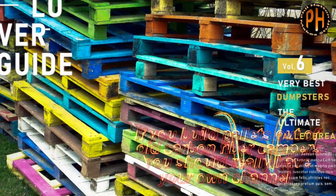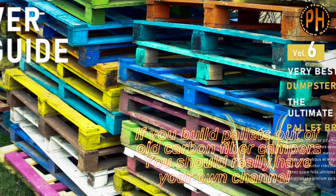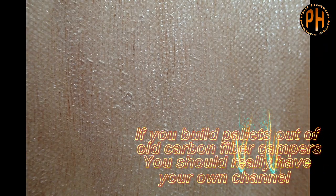Before we get to the epoxy-a-thon, it's important to note that you will be dealing with bubbles and air pockets. They're inevitable, and you can live with them or you can fight with them. Unless you have a large budget and you can do one of those slick vacuum bag jobs, you will get air pockets, especially where there are corners. That's why in the last video it was so important to round over the corners and make sure we didn't have any voids or unfilled crevices. If you get any bubbles or have difficulties, they will probably be at the corners between panels 2 and 3.